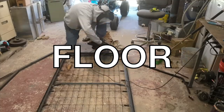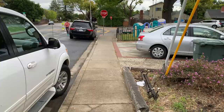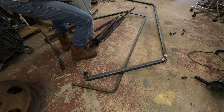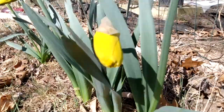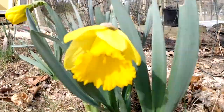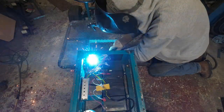I cut up some more bed frames for the steel to make the floor — I collect them from dumpsters, you can even find them on the side of the road. The steel is hardened, so best use a friction blade to cut them up, but be careful because they're totally spring loaded. I found some rusted expanded metal, wire brushed it off, and it makes a great floor.